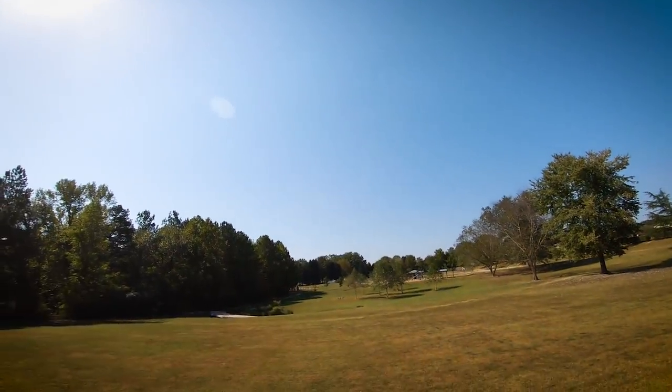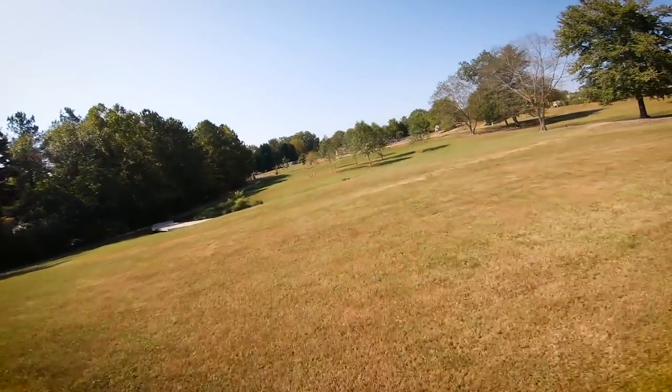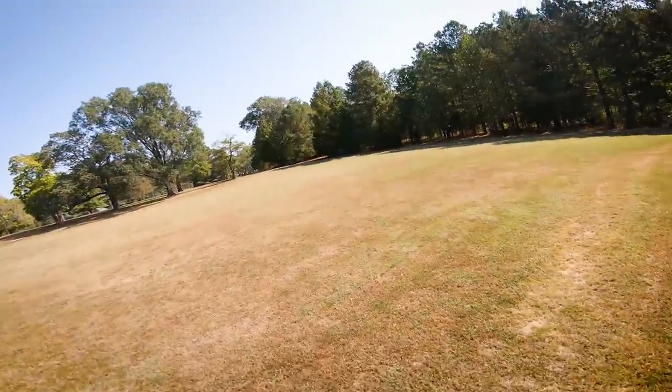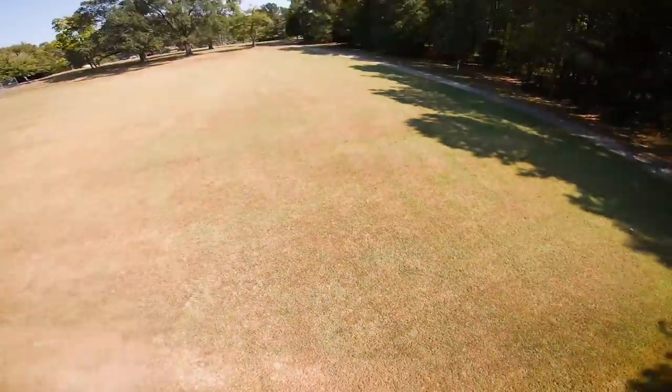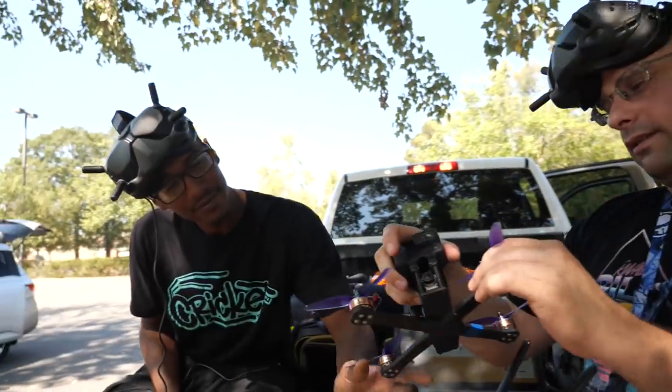It's way more stable now, but we need a little more. There's a lot of wind out there. Good prop wash handling in the turns though — you can barely hear any oscillation. The motors are starting to get a little concerning — that's on the edge. When you do your test hover after moving sliders, don't just arm and jam the throttle because it could fly to the moon. Just ease into it. Safety first. Work these sliders as far right as you can get without hot motors and the quad is flying about as good as it can get.